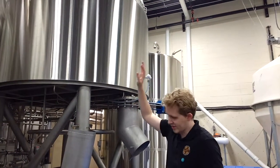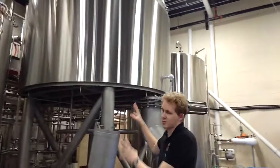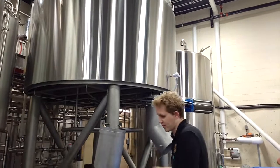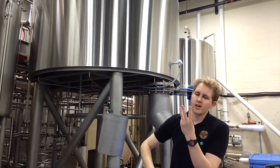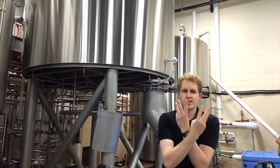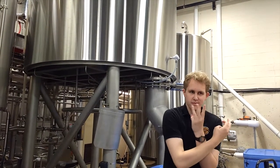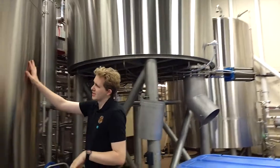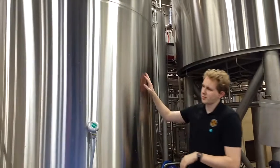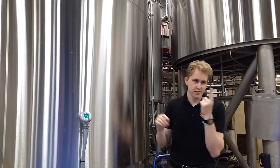Yeah. So what we're going to do for whiskey is we won't actually use fresh water for the first water that we put in. We're going to put in 3 waters. The first one that we use is actually the last one of the previous batch of whiskey that we've made. This will make a little more sense in a second. Essentially there's some residual water in here from previous use, and we're going to heat that up, and that will be the first water.